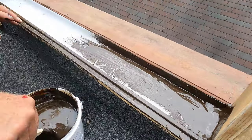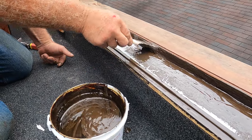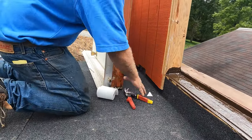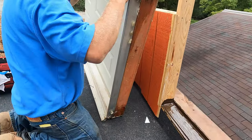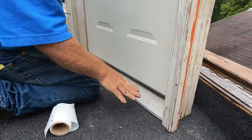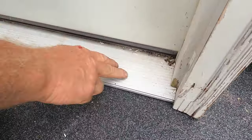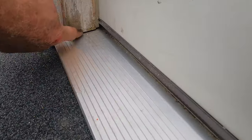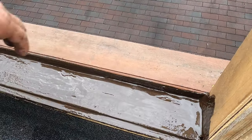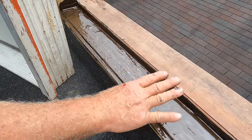Now I have to do this as well — coming over this plywood and over the roof here. But this is now the inside part. Another place where water leaks if you don't have that. Water will travel underneath this wood here, underneath. See here — water travels on both sides and it will go right here, fill up this pan. You cannot not have this — you have to have this.